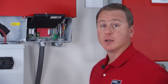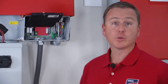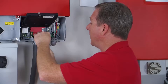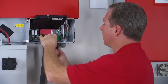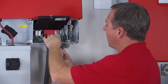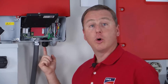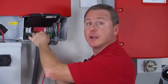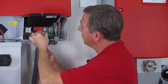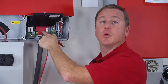Once the ribbon cable is secured in place, go ahead and lift up the LCD display again, because now you're going to install the cable gland in one of the open three-quarter inch knockouts. So I'm going to put this one right here. Once you get that nice and tight, the next thing you're going to do is feed your ethernet cable through one of the open holes in the cable gland. Now I'm going to pull the ethernet cable through the cable gland and connect it into an open RJ45 slot on the WebConnect module itself.